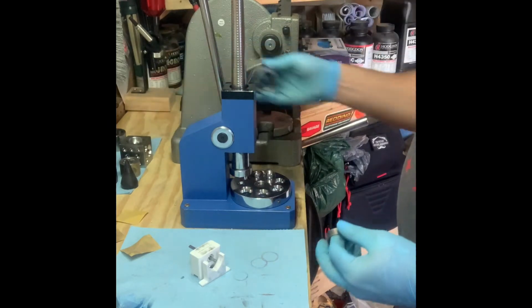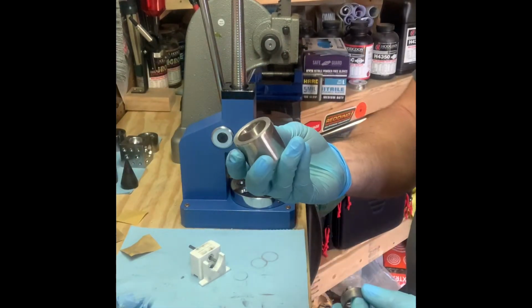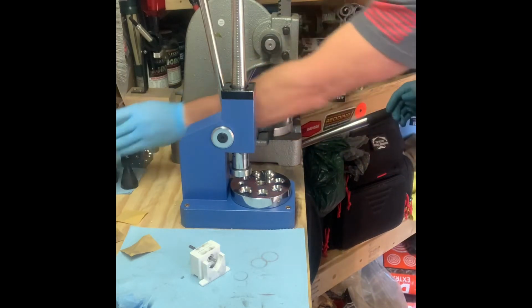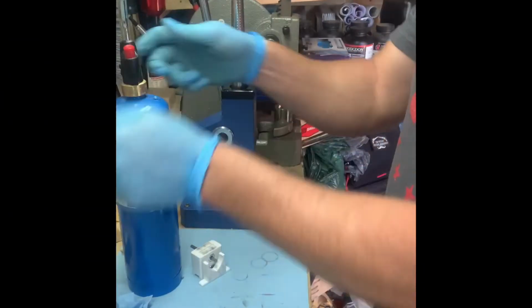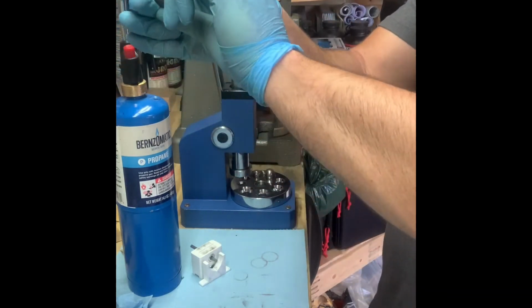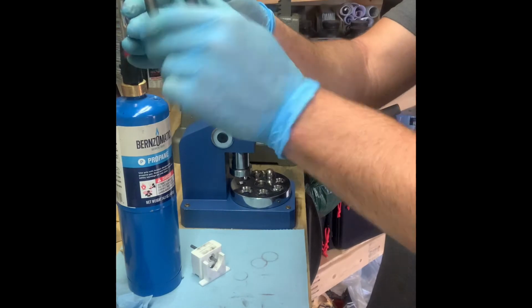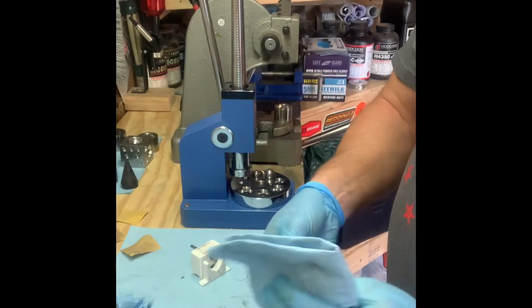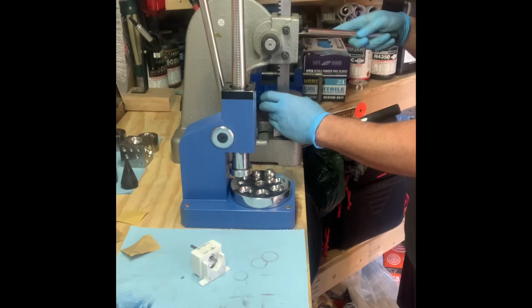All right, so to do that, typically I have to start, looks like I'm going to be okay. I'm going to use the 1.1 side, this die. Feels a little work hardened, and I'm going to heat and quench it again. Back to the die. Remember, I'm trying to get that to a 10.5 or 11 size.